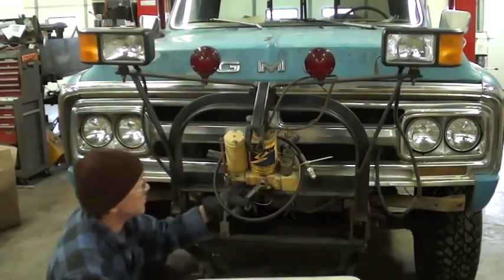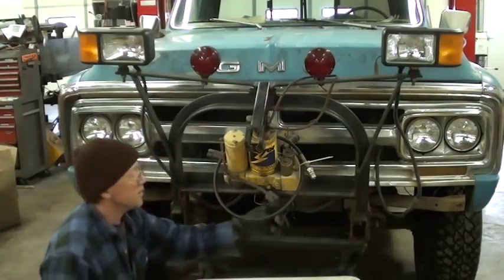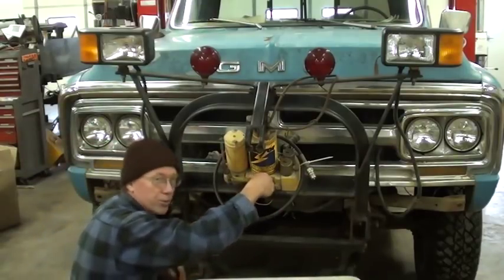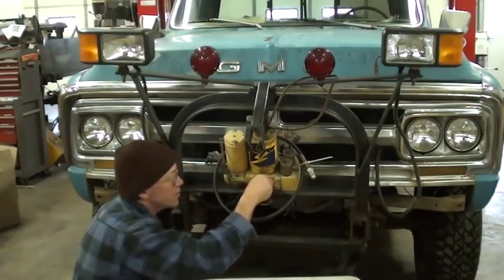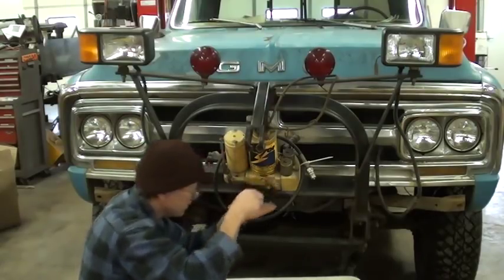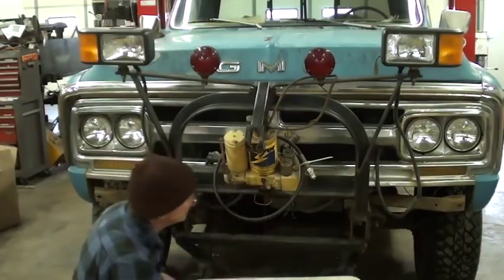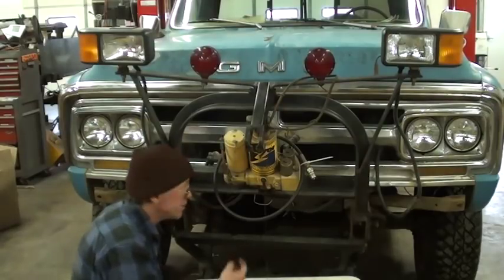One of the things I found on there, this is my hydraulic oil drain, and these two are filters. Get out of my way. So, not only do I want to drain it, because they say to change your oil every year, the greatest amount of damage they see in these pumps is water, because the water freezes and then cracks the base.